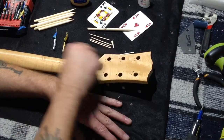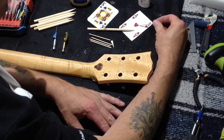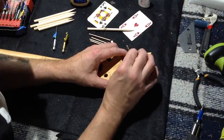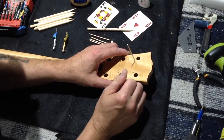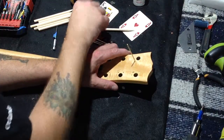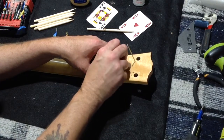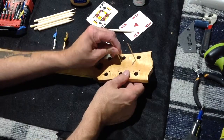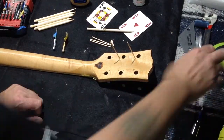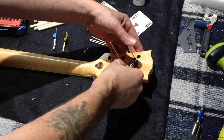After I clean out the openings, I'll take a little bit of glue — that's my drop-fill glue. You can use anything from a little super glue to Titebond. With this way it's a little bit messier, but you stick it in there and with the CA glue or crazy glue you can cut it right off.